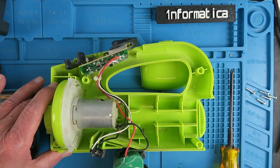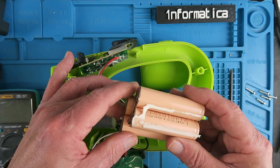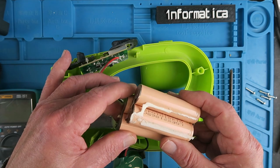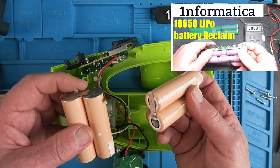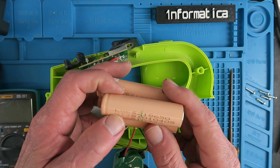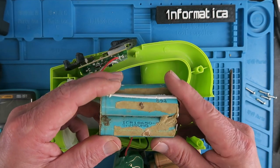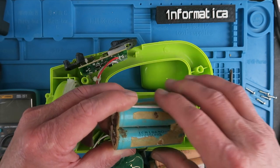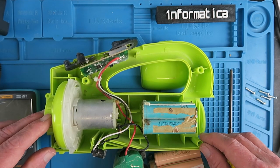To replace this battery pack, what we need I think are two pairs of 18650 cells. These have been recovered from old laptop packs but they're generally pretty good. I keep them in their pairs once I take them out of the battery packs — that way I know that they're well balanced. These particular cells are LG. I have some others which are Samsung, and we'll do a quick test on these to make sure they're good and select the best cells for the job.